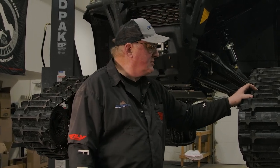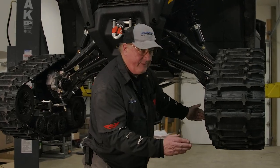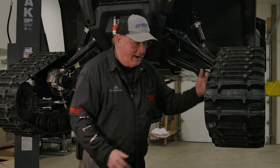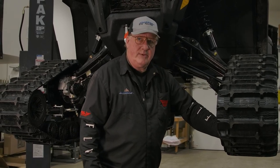People won't have this issue with tires, because there's only six inches of contact on the ground. But when you've got three feet of track and you're toed out, it really pushes the track one way or the other and causes excessive wear on the knobs of the track.